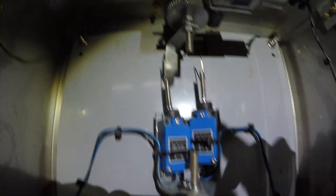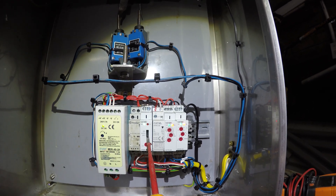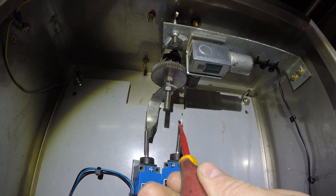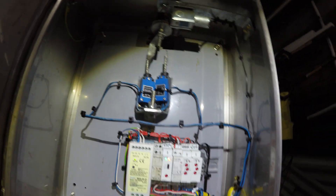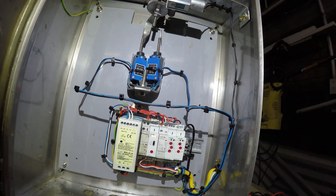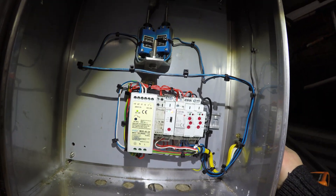It'll stop there, catching the sun for the rest of the day. Then at the end of the day when it gets dark, it'll work its way all the way back to the start and turn off when it hits the limit switch. Pretty simple really. The enclosure is a stainless steel cover, second hand, IP rated — no water should get in.